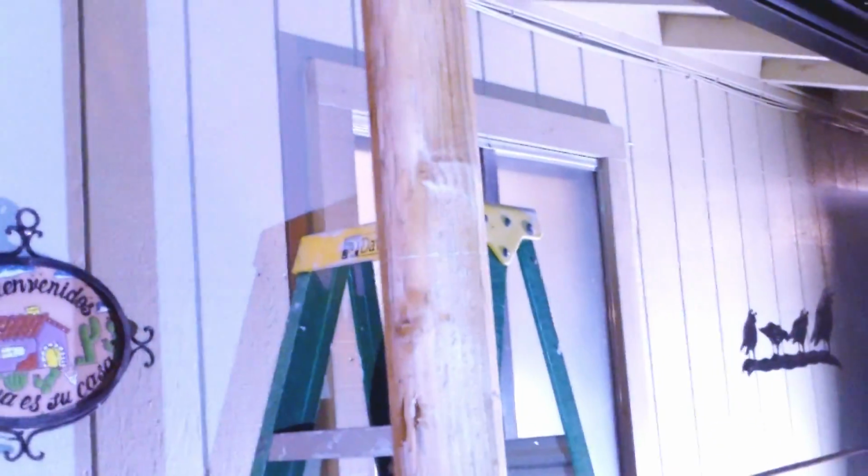So once those were up, then what you do is, to the rafters of the house, we screwed this board that goes the length of however long you want to make it. The reason we did this is that we put 2 screws in each one, and this is going to give us a good strong support to put our cross beams.